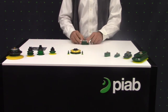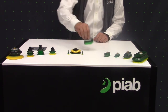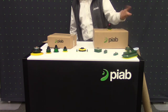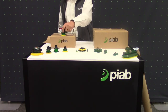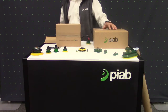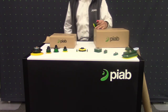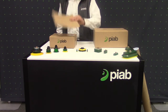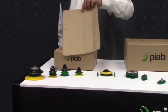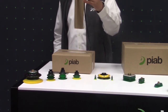The bellow support offers more stability when the cup is collapsed under vacuum, as well as offering some resistance to any sort of shear forces as the product is attached to the cup and moving. For the larger box, picking right across the seam — nice and easy pick, you can see the cup is completely collapsed. Now for the smaller box — again, nice easy pick, the cup is completely collapsed. There is a bit of a gap across the seam here comparatively, but still a nice easy pick. And now on this beat-up piece of cardboard — likely from a slip sheet that's been used a couple of times — you can see a nice central pick on the seam. The cup is completely collapsed, holding it in shear, no problem.